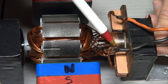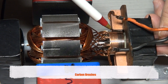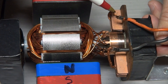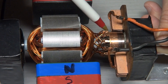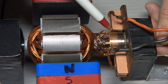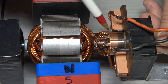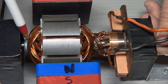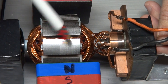The other key component of the DC motor are the brushes. These brushes are made out of carbon. They have the ability to pass electricity coming through the wires provided by the battery. Once the switch is turned on, the current goes through the brushes. The brushes make contact with the commutator plates and provide electricity through the copper wires or conductors connected to the plates, and from there provide the current to generate the magnetic fields to interact with the stator assembly.